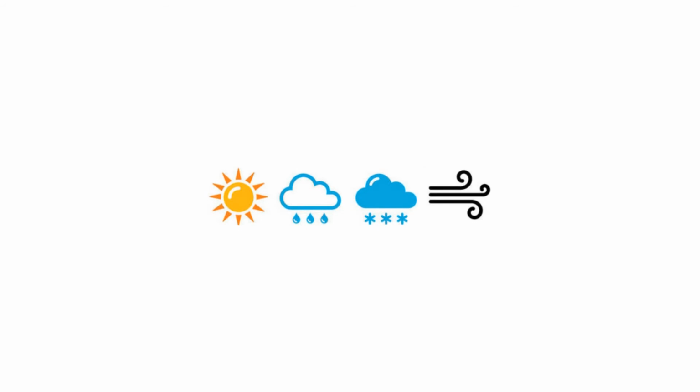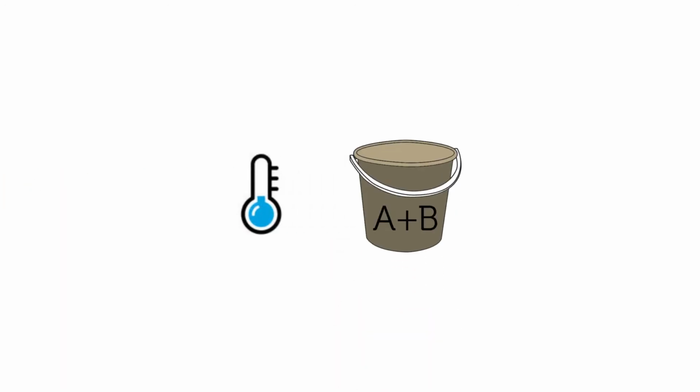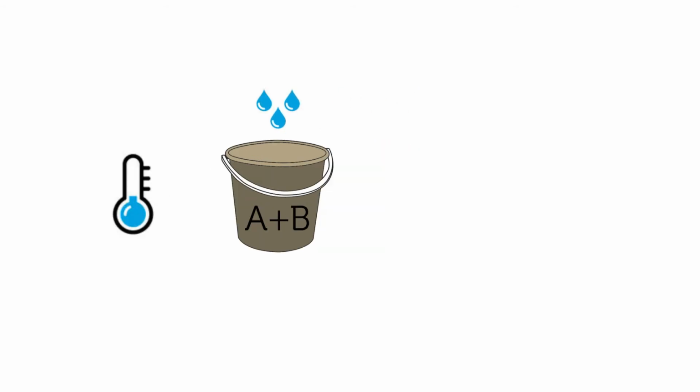Check weather forecasts in advance. It is vital that the uncured resin is not exposed to rain, hail, wind, debris or humid conditions during the curing process. Any form of water or moisture must be avoided. In cooler weather, we recommend that you add the prescribed dose of catalyst to the resin binder mixture to stabilize curing times, as low temperatures can prolong curing if left untreated.